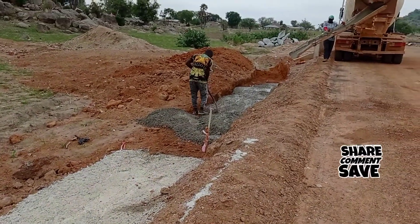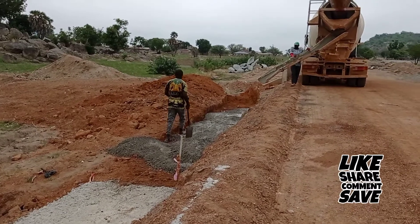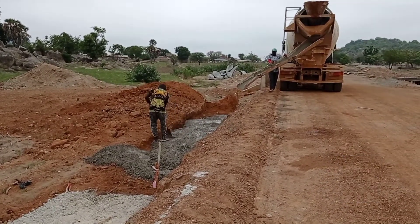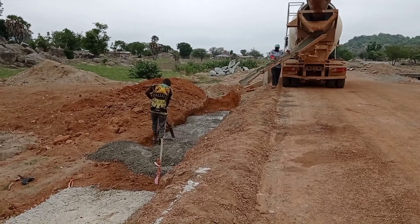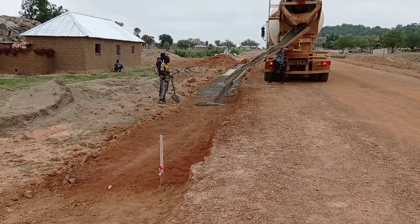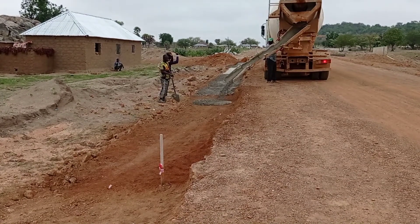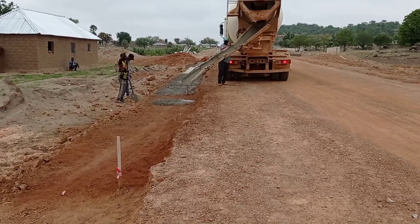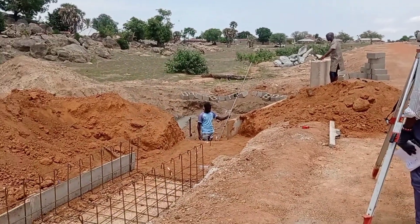The total width of our drainage is going to be 1.2 meters. With the help of a transit mixer, you may see that we are pouring concrete. We had placed the levels, and for each one meter we had a slope of three centimeters. We have to make sure that we give a slope so that the water may flow out.